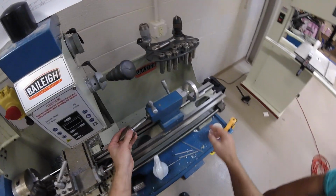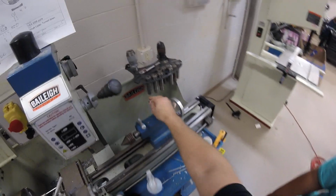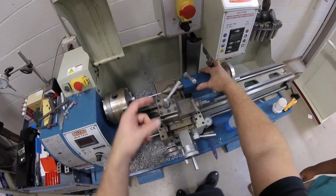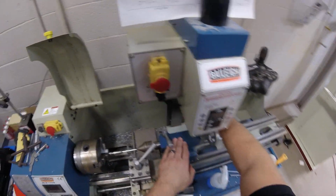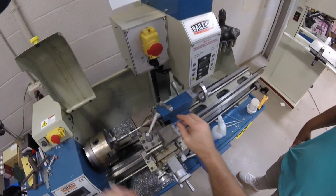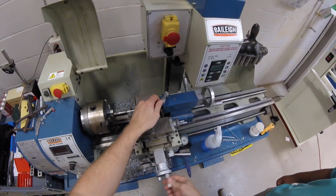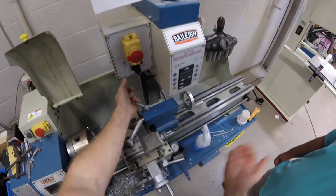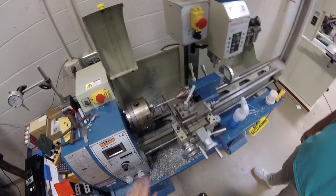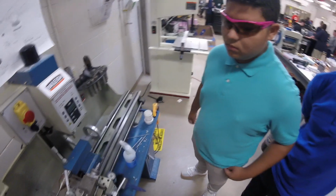Press fits, okay? As you roll out, we can roll out just kind of eyeballing it. Then we pull this lever, bring it into our material, and as you see, it seated itself, okay? What we had to do first on this fixture is find exact center on that axle. Now that it's there, we're going to tighten it slightly, and then lock this tailstock so it can't go in and out anymore, okay? That's locked in place. So right now we can spin, and we're pretty much directly in the center of this.